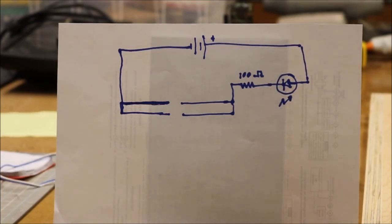Now, you might ask why I did it this way with an LED and a gap. Well, the reason is that if you hook up a DVM to this, it's too slow to see the continuity. Sometimes the continuity is very fast, and a regular DVM, digital voltmeter, or even an analog voltmeter may not catch it. And you can see that, I'll show you that in the demonstration. Sometimes it's just a quick flash, because some of these wheels may be coated. Looks like some of them are coated a little bit, and the continuity is just momentary. But I'll show you how that works.